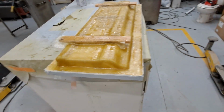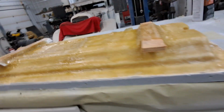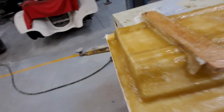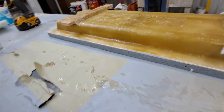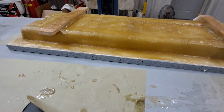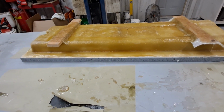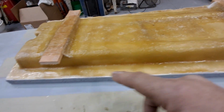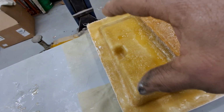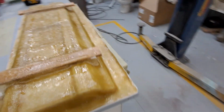But basically now I could take all the screws off and we can reveal the flange. I'm only 1 or 2 layers thick on the flange. Looks like about 2 layers thick on the flange because that's waste for the most part, but I want a relatively flat plane when I'm laying it up so I can make sure that I get over the flange and have a surface that I can cut perfectly straight when I'm all said and done. I packed quite a bit in here for the purpose of the mold, even though I'm probably not going to pack it all the way up.